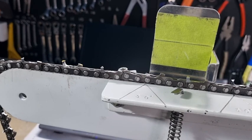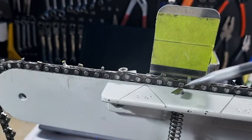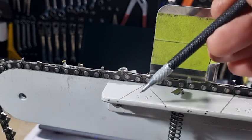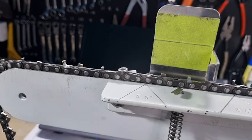Attack angles are a very interesting subject. Everything has an attack angle when we refer to woodwork or metalwork — if you hold a chisel at this angle, this is called an attack angle. All different angles penetrate the wood at different forces required. If you have a very aggressive attack angle you may need a much more powerful chainsaw. An attack angle of around five degrees brand new is fairly normal; going up to six or six and a half is getting into a nice aggressive attack angle.